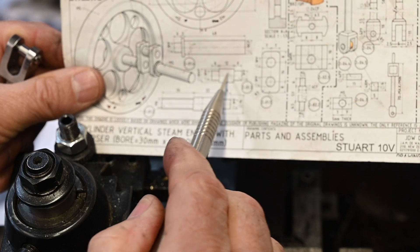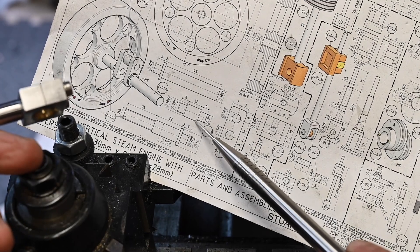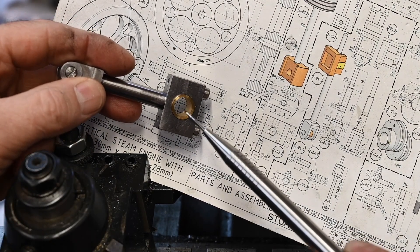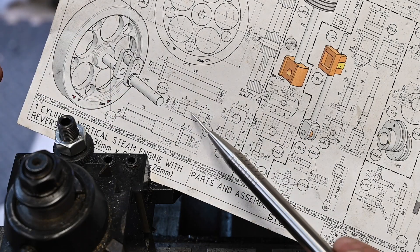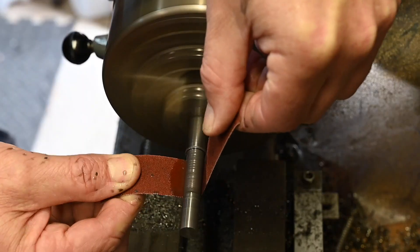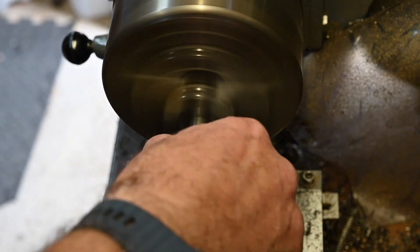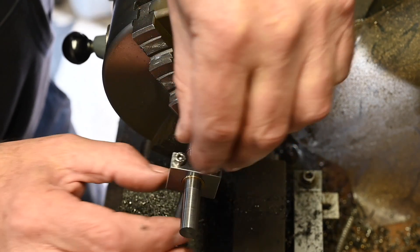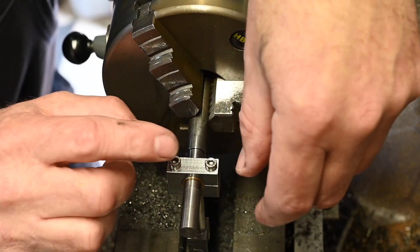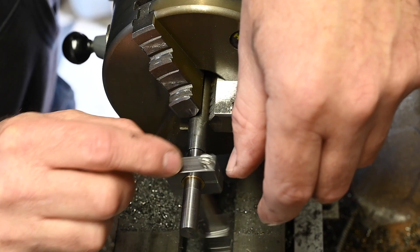Going to make the centre piece next. This centre piece calls up 10mm variable fit - it's got to be machined so that it fits the bearing on the crankshaft, which is slightly under 10mm by a couple of microns, so when I get near I'll just be trial fitting it. That's a lovely fit. I over-ran on the first bit so I'm just going to cut that off, but that's perfect.